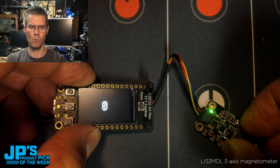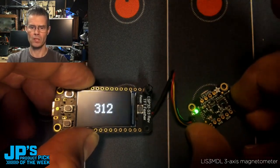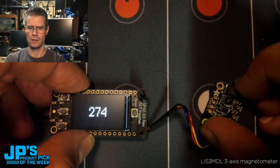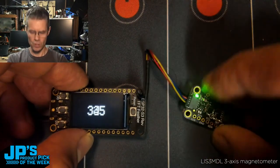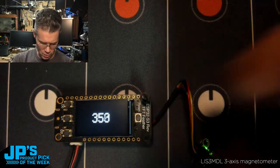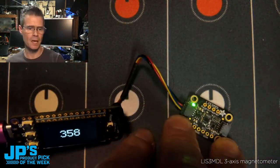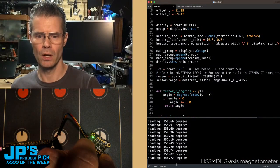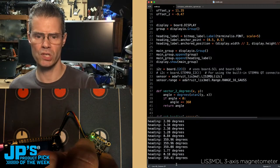What this is going to do is print out the compass heading. So when I get to about zero or 360 — 359, one — that range of things, that is north. And you can see we can point this around, pivot it around, get about 180 — there's south, there's west, find east over here. So I just have it spitting out the degrees on the display there. You can also check out with a little finer grain detail — I just didn't want to print out decimal places on there to keep the display neat. But if you look here, you can see I am printing out to the serial REPL there, degrees with a couple of points of decimal precision.